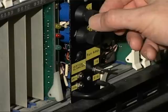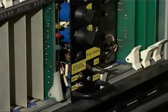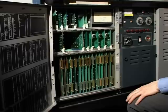These controls will alter the apparent vertical height of the images as seen on the picture monitor. A convenient signal to calibrate the waveform monitor is provided in this case from the DigiScan board. Flicking this switch gives me a signal of 0.7 of a volt, which I can use to calibrate my scope.